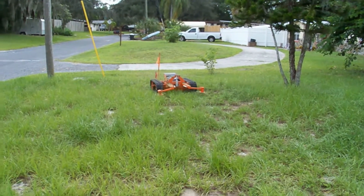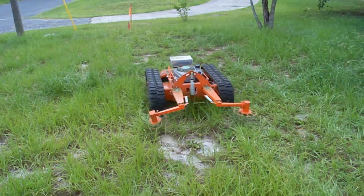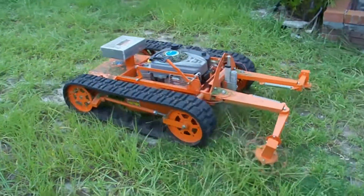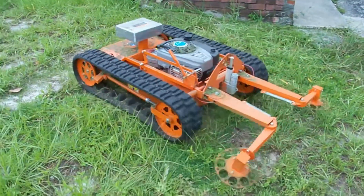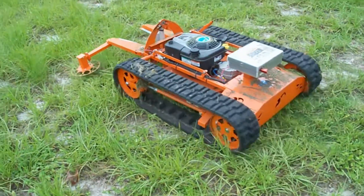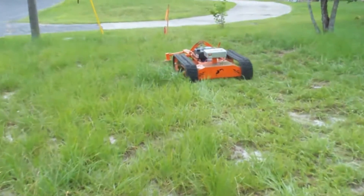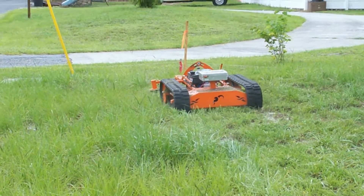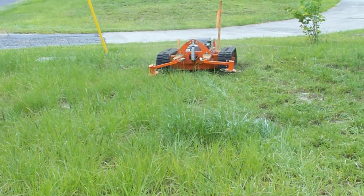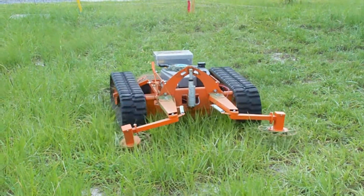You can move the blades in and there won't be any kind of line in the grass. The robot looks pretty good. The test is going well — it's pretty new for us. We added a lot of protection, added a lot of fuses and other components to protect the machine in case of any power spike or surge, or if something got bound to the trim arm blade, or the linear actuator got bound up when raising and lowering the cut height. The idea is that we want these machines to last many, many years. Some of our machines have been in the field for 10 years with just regular maintenance, and we want to keep it that way.